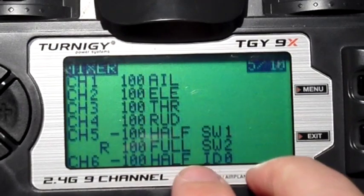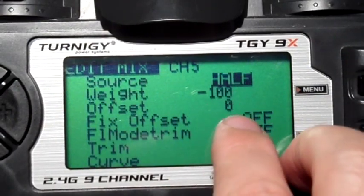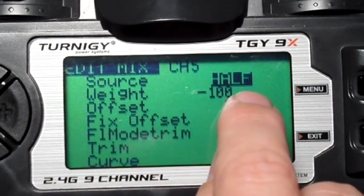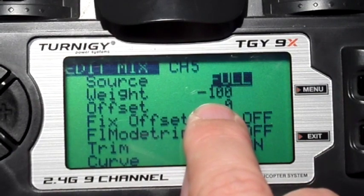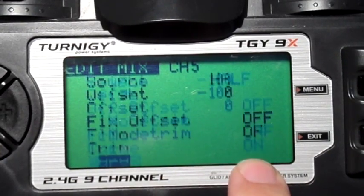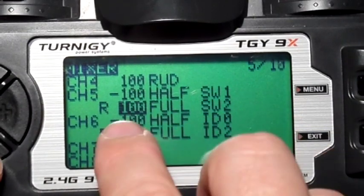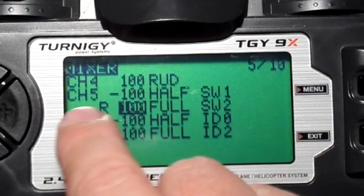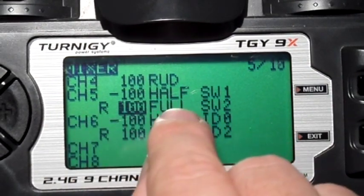Which gives us Switch 1 and Switch 2. So if P1 is less than 87, we're going to get minus 100 on channel 5. If P1 is greater than 87, because we've set the source to half, it's going to get a zero. You've got half and you've got full. If full, then it's going to go from minus 100 with the switch being active to plus 100 if the switch is inactive. Whereas half goes from minus 100 to zero if the switch is inactive. Then SW2, which is above minus 62, we've set to full 100. But the main thing is we've used replace, because the switch is still going to be above 87 — Switch 1 is still always going to get set to zero. But if it's also above minus 62, then we want to kick in and replace that zero with a plus 100.